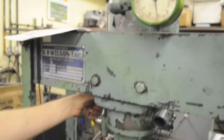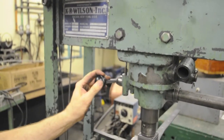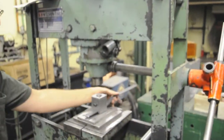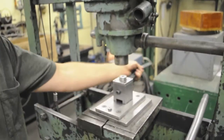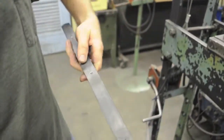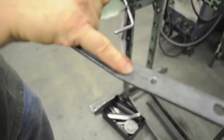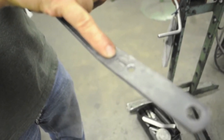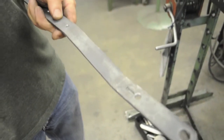Okay, now pull the black knob forward again. That releases the hydraulics. Raise the ram, lever back, pull the part out. You should be able to see a faint, at least part of a round impression from the round part of the punch on your part. That lets you know you went deep enough.